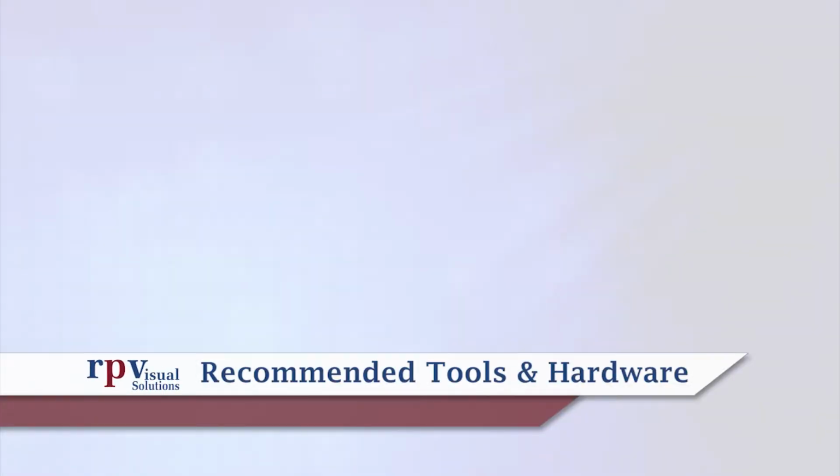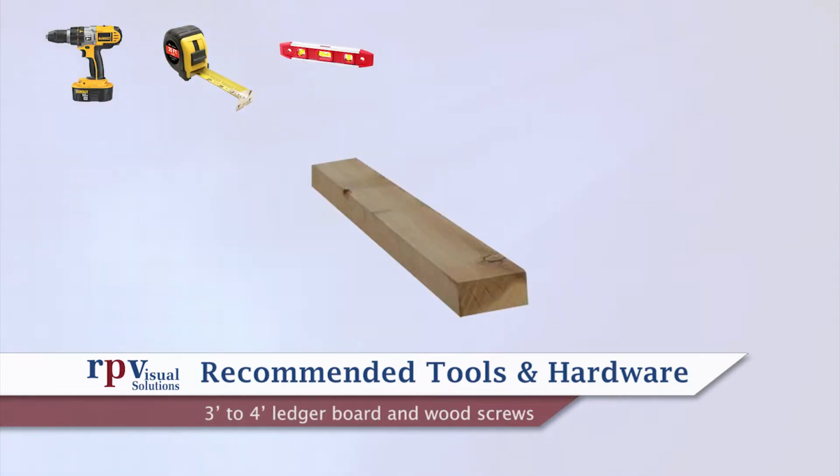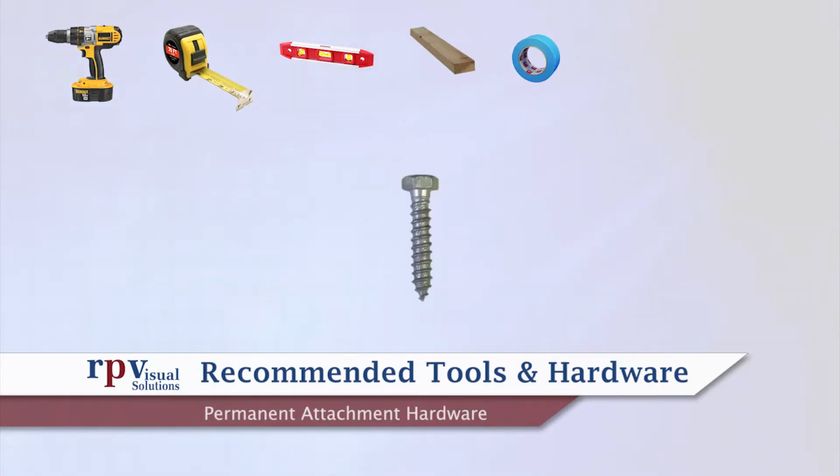Recommended tools and hardware: a power drill, measuring tape, a leveling device, a 3 to 4 foot ledger board. This can be a 2x4 or similarly straight and rigid lumber, painter's tape, and permanent attachment hardware. 3/8-inch lag bolts are typical for wood-framed walls, but RPV does not make any specific recommendations on permanent hardware, type, or frequency of attachment. Consult your structural engineer or general contractor for specific recommendations.